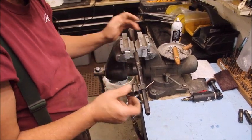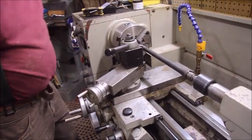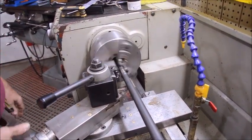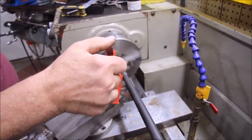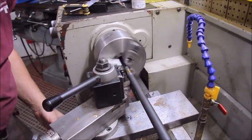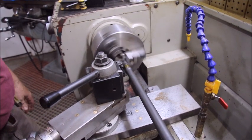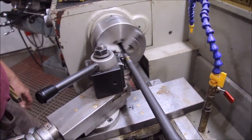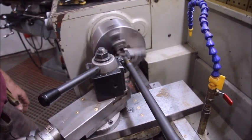So what we're going to do is walk over to the lathe and knurl the journal. We have the barrel mounted in the lathe with a knurling tool on, low RPM, right hand feed, and it doesn't hurt to add some lubricant. What this is doing is displacing the metal, which will slightly increase the diameter of it, but my experience has been there's usually not enough.